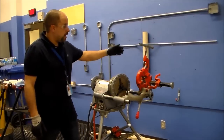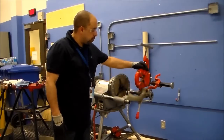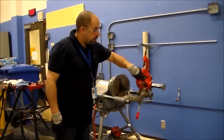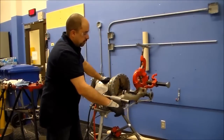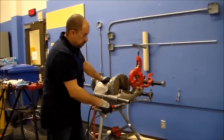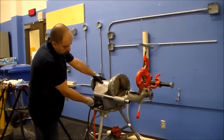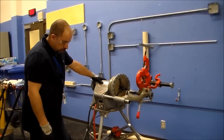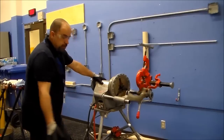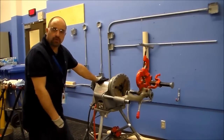Once that's done, you should have a cutting tool for cutting the pipe, the threading tool, and the reamer, which can be in two positions. The handle for the rotate that brings the tools in should be sliding very freely. Your switch has a forward, reverse, and middle position, and your foot pedal in the opposite position should not work. Put it in reverse and you should see your machine come on and rotate clockwise.